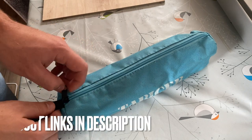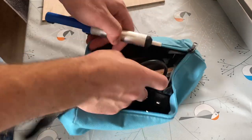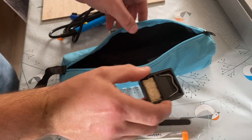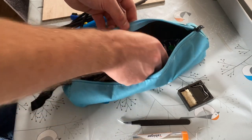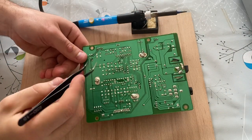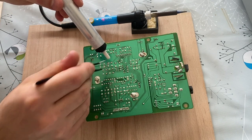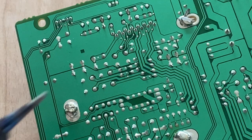The capacitor has turned up today, so I'm going to swap it out on the board. This is my soldering iron kit — I got this off Amazon. It's got everything you need: solder sucker, soldering iron with various nibs, tweezers, solder, a little stand with a sponge, and different angled tips for doing different things. So capacitor C207 is this one here. I'm going to heat that up and use a solder sucker to suck up the molten solder, and then the component should just come out.